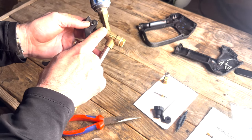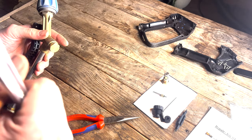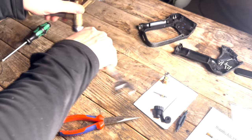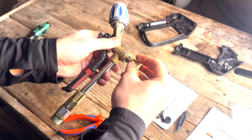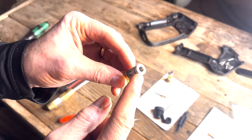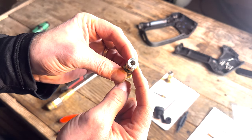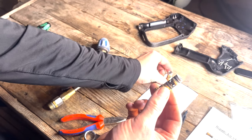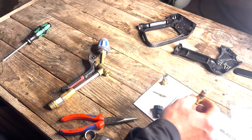All the repair kit here is in this valve here and you have to take this nut off. This nut obviously is the 19mm nut. And then you take this valve out. Sometimes you can find just a little bit of grit in this valve and that's holding the ball away from the seat, and that can pass water through — or even if one of these o-rings are gone, it can pass water through. But this is a whole replacement cartridge so it could be just something trapped in there, so you might not even need the kit. We're going to replace it anyway.